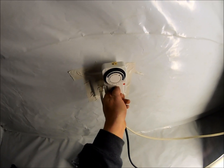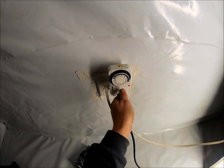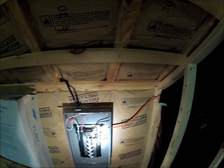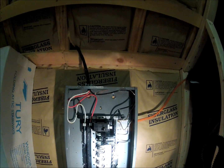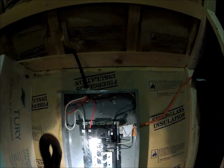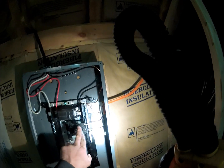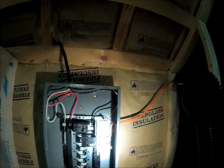I'm going to leave the timer plugged in because I want the time to remain set, but I'm going to unplug this - and you'll hear it click as the power goes off. I just finished wiring up for that light controller. I've got a brand new box I just put up to bring power closer to my grow rooms with a 30-amp breaker. This is the line that comes into the grow room - both of those are hot, that's 240 volts - and the ground connection. It's sending power out to the controller.